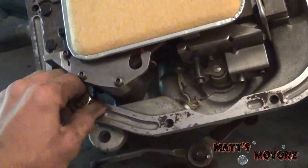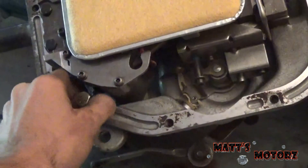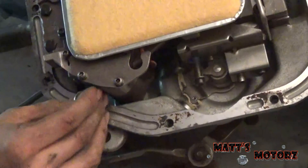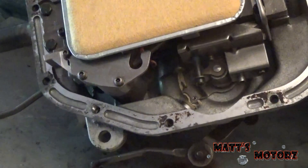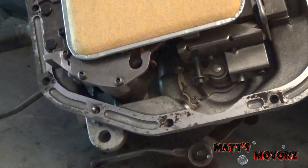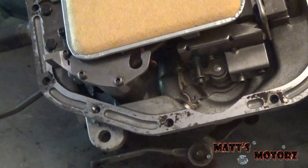Then we're just going to test fit a bolt. There you go — now this bolt is too big so I've got to cut this one down, but that's all there is to it. I could use a bottoming tap to get a little bit more threads in there, but for now that's going to be good. That was a quick video on how to drill and tap a hole. Hope you enjoyed, thanks for watching.